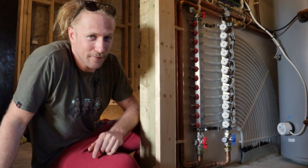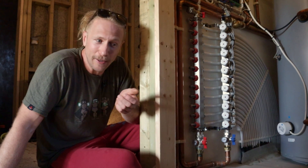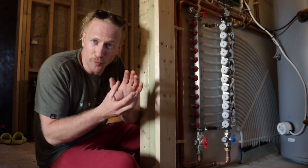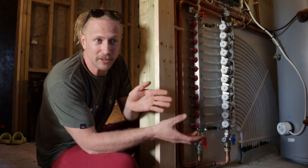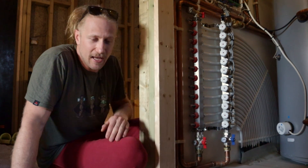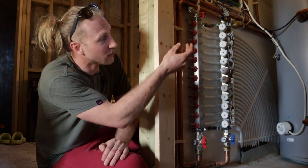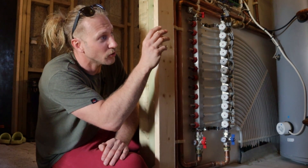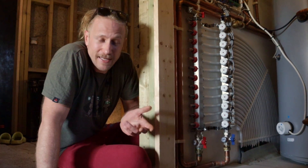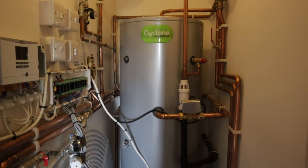The control group is something I discovered when installing the thermostatic shower in my en suite. I read that thermostatic showers don't operate well with air source heat pumps because they introduce cold water, which doesn't work well with the low temperatures an ASHP puts out. I called the technical support and they said it would be fine as long as pressures are matched — and that's exactly what the control group does: it balances the pressures of the cold and hot water. We've been using the shower and it's been absolutely fine; the system is set to 45 degrees and it's actually too hot so we've had to turn it down.